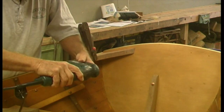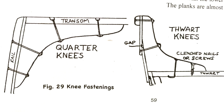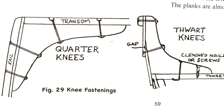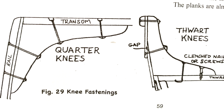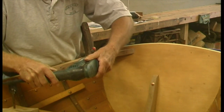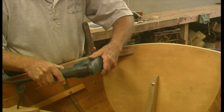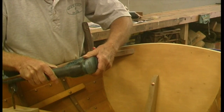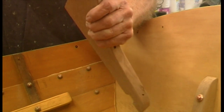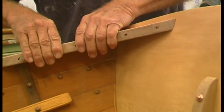Line up your long series drill bit very carefully because both the nail head and the rove end are usually visible. Clamp the knee in place and pencil in the positions of the fastenings, ruling a line across the knee for the drill to follow. Drill the holes through the knee first on the bench, then clamp it back in place and continue the holes right through. When you're ready to fasten off, drive the nails from the outside until the points just protrude at the mating surface, then locate the knee over the points and drive them through, backing it up with a dolly.